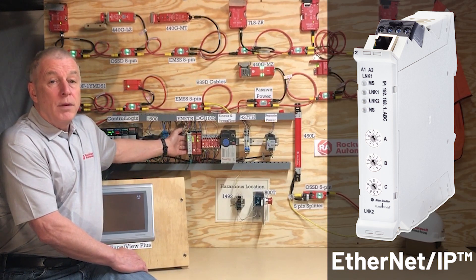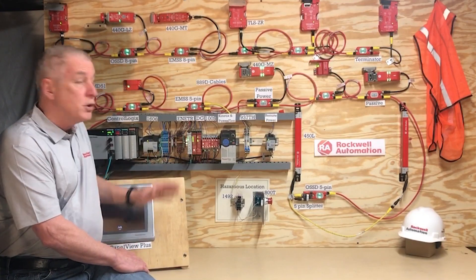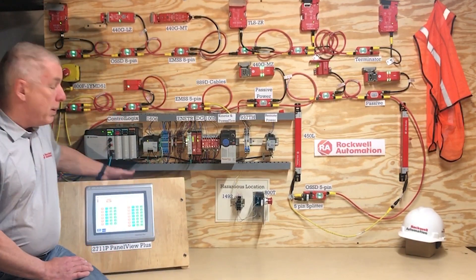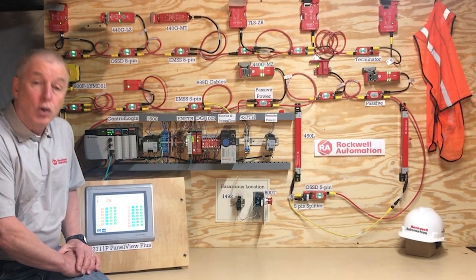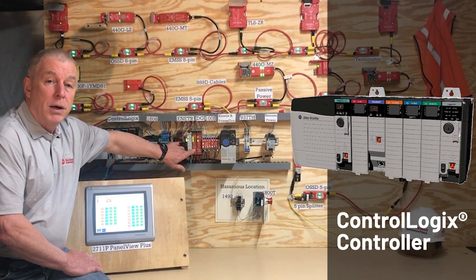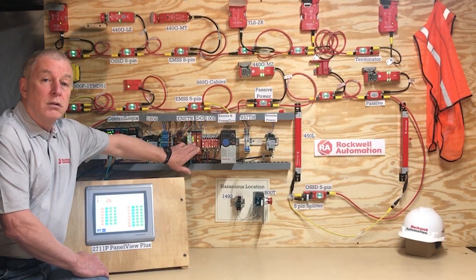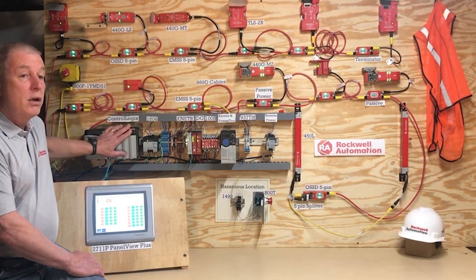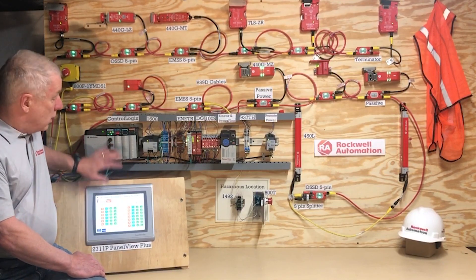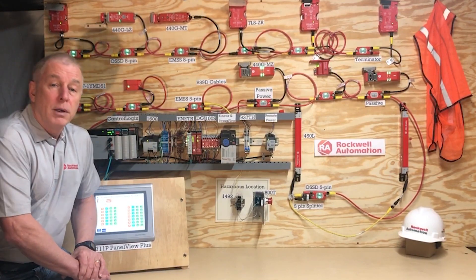On the communications side, we have the Ethernet module, which talks to the DG over an optical link located in the back of the housing — there are no wires between the two housings. The Ethernet module is connected to my PanelView, which connects to a ControlLogix. We only need ControlLogix here because the safety system is controlled by the DG — we don't need GuardLogix. What we're doing is sending status signals from the DG back to the ControlLogix, displaying them on the PanelView, and sending lock and unlock signals back to the DG relay to lock or unlock gates as appropriate.